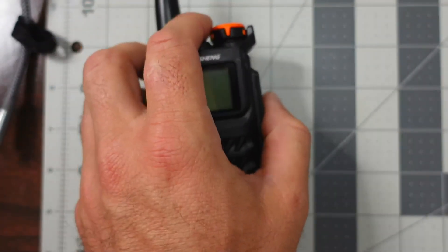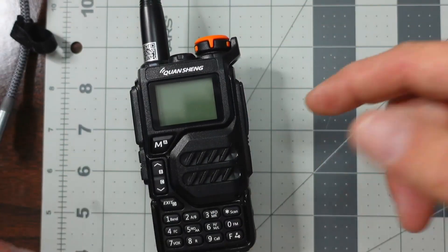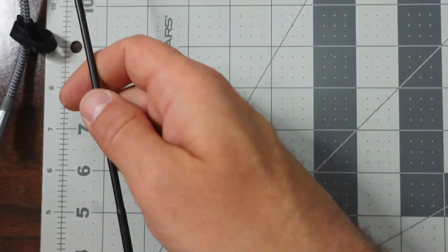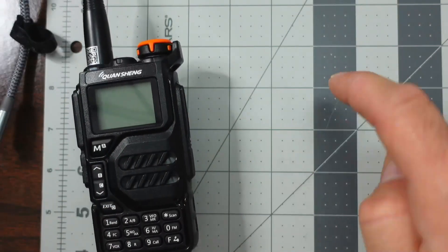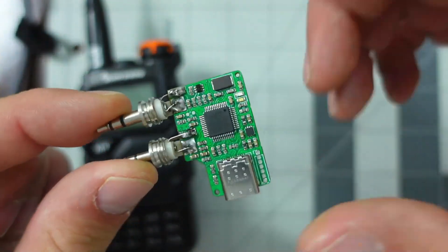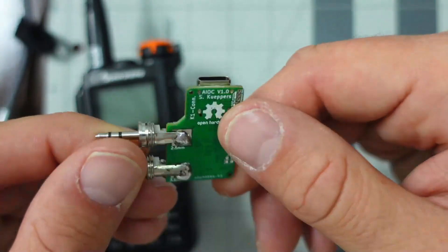Let's jump into how we use APRS with this radio. APRS would be a good function for something that's kind of allegedly like a Swiss army knife of radios. We have the radio itself, and I went ahead and got an external antenna because the receive on this radio is not the greatest. The next thing we need is what they call an AIOC cable. These are kits — I'll leave a link to the GitHub below — but you can go to jlcpcb.com and build one of these, or five of them, for you and your friends or your ham club.